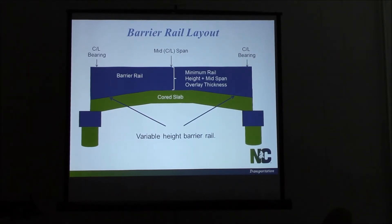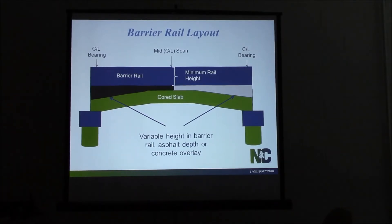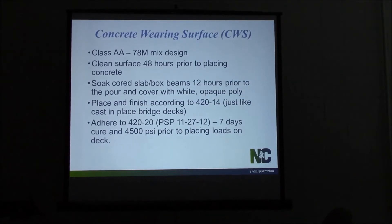The minimum rail height is at mid-span where it's the shallowest because of the camber. You'll need to use the grades in the plans to get that minimum rail height above finish grade. It will be thicker over top of your bent lines. To accommodate that for our wearing surface, asphalt will have to be wedged over top of the bents, and if we have a concrete overlay it'll be thicker over the bents as well. Whether they're hand forming or setting a string line for slip forming, make sure they adjust those grades — just keep that in mind for the concrete wearing surface.